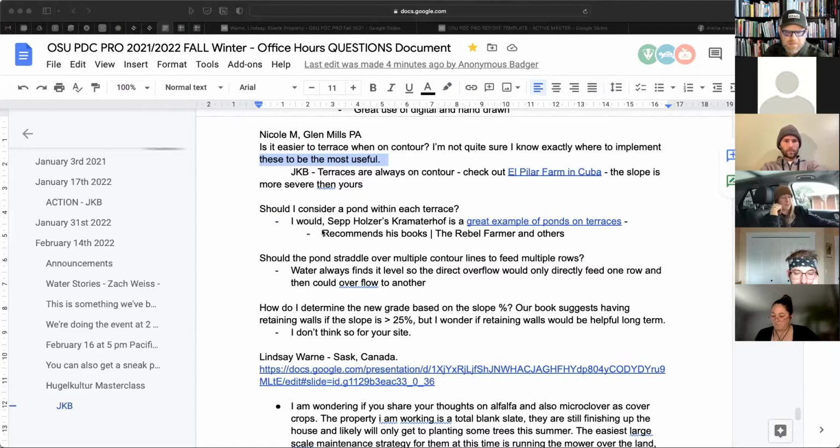Generally, when I was doing the math for it, basically I would just do cut and fill, cut and fill, cut and fill. That soil will find its own angle of repose. That angle of repose is the angle that any material will find and settle in. So when you take a look at sand, let's say, sand has a shallow angle of repose, because if you put a big pile of sand down, it would have a very shallow angle. If we had, let's say, silt or clay or loam, and let's change color just to make the point, it would have a higher angle of repose.